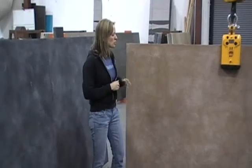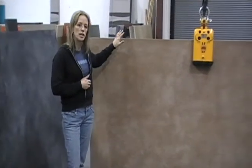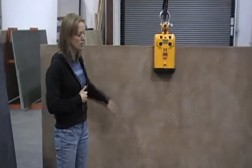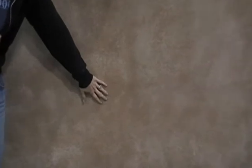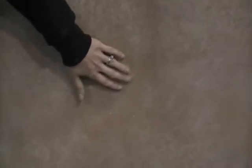One of the things that we've done too is we've upgraded the vibration technology that we're using for making the slabs, and what it ended up doing was eliminating some of the larger air holes that people were used to seeing, maybe in the edges or in the faces of the stone. And I want to point out that it didn't entirely eliminate holes. We still get air bubbles on the face of the stone. That's just the nature of working with a fiber cement material. And we still go through and hand finish them and fill them in. And so you should expect to see that there's still going to be some tactile quality and some character associated with this material.